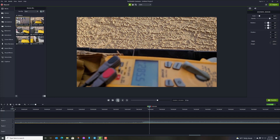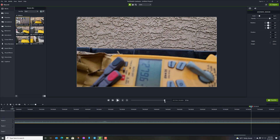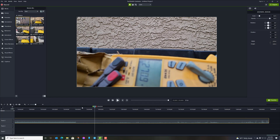That's the Goodman unit next to it. The Lennox unit, the three-phase unit running on 40 Hertz which is first stage, just keeps running. I have it set lower than the downstairs unit just to keep the upstairs unit running — the downstairs Goodman unit is pretty much all or nothing, it just runs until it cycles off. At this point it was 270 volts, and I think this is when I pretty much called it.